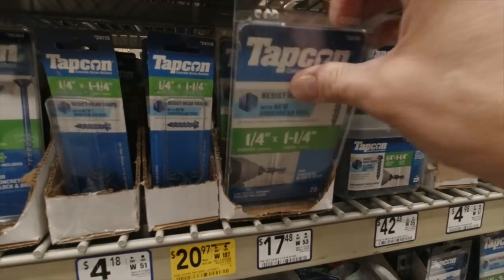Here's my idea for these eight blocks. There are four sets of struts or supports that hold this garage up, so that means there are eight feet along the sides. Some folks use four by fours or blocks of wood under there and bolt the garage down to that. But I was thinking that if I can place a block under each one of those feet and use some Tapcon screws, that would add the weight needed and raise it up off the ground four inches.